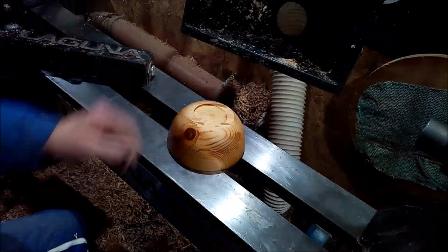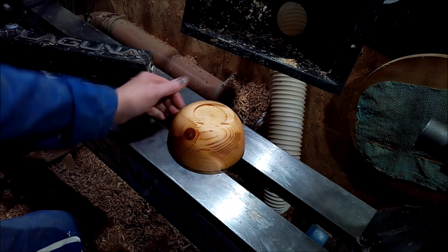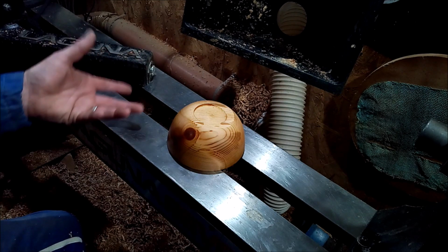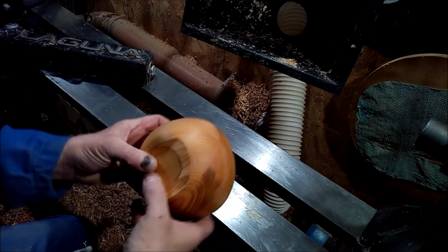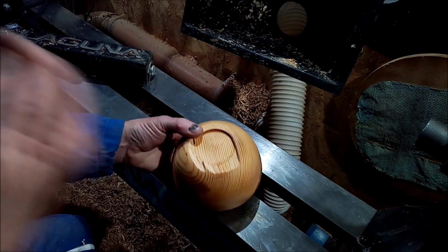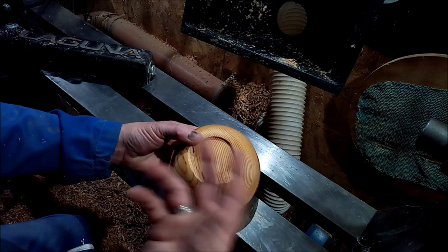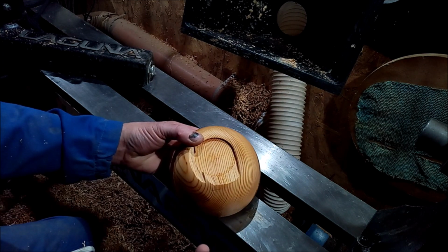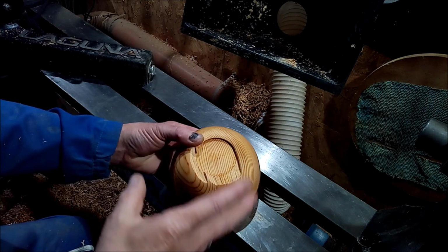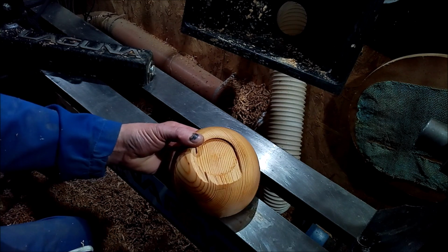Right then, well, that didn't go as planned, obviously. And as I promised ages ago when I started the channel, if something goes wrong, I will always show it, and if I can, explain what happened. As I said, this isn't great timber to use. It's just construction timber. Where I made a mistake trying to save myself a few seconds was I used a mortise instead of a tenon. Now, with this wood, even with a tenon, they can blow.